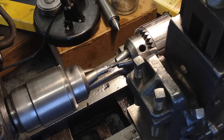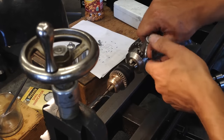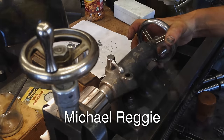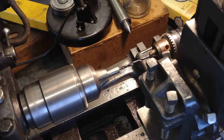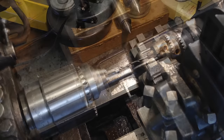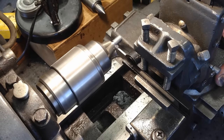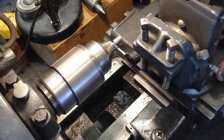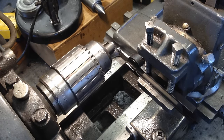I had to get in really close with the camera. I'll tell you what, I almost think I need glasses because I was having a hard time seeing that small stuff. And here's a little bit of bumblebee engineering — as Michael Reggie would say — my chuck would not hold that drill bit, it wouldn't go down that small. So I grabbed a half-inch chuck, cut off the head of a bolt, stuck it in there, and clamped it in. Then we drilled and tapped it. Here I am parting it off — a little bit more chatter, had to go a little bit slower and easier, but it did part off alright. I was really surprised by this milling attachment that it actually did work as well as it did. So there's the cotter all done — well, not all done.